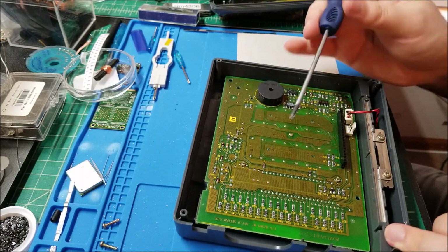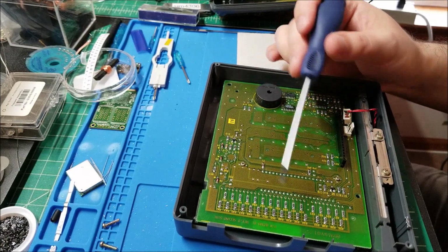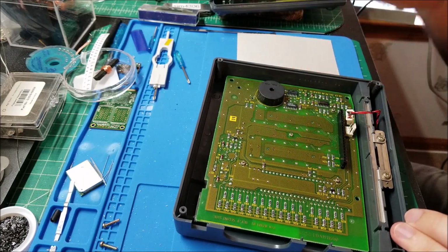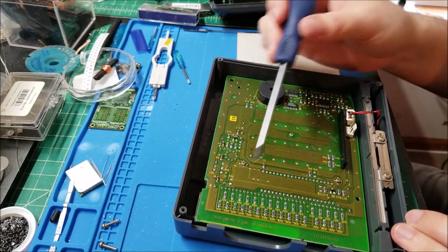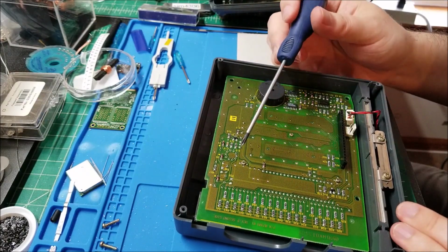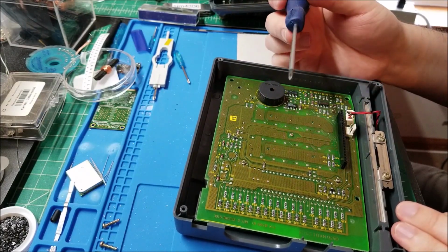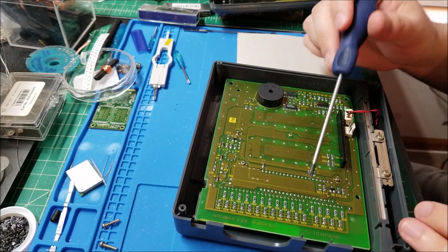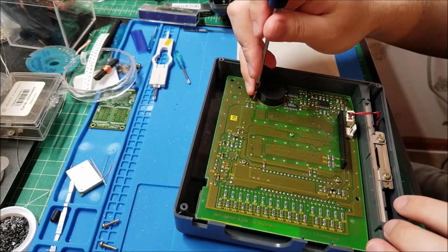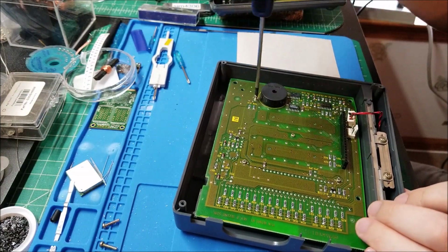And yeah, just another quick note. The reason why you need this transformer for the VFD is most VFDs require higher voltages. This is going to be a multiplex tube just because it doesn't have like a million pins coming out the back. So you're going to probably require for this tube anywhere from like 40 to 60 volts multiplexed in order to light it up. So that's why they use like a switching transformer to generate the higher voltage necessary.